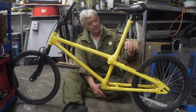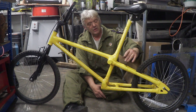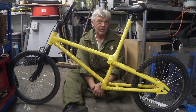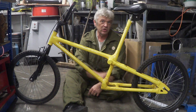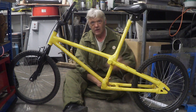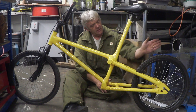On a normal bike the rear stays have a bend in them past the wheel. I didn't think it would be easy to bend this paper tube, so I carried them straight through to a cross piece with 90-degree joints instead. It would certainly be worth trying to put a bend in them to bring them around like a wishbone — that would be very cool — but I went with straight for this prototype.